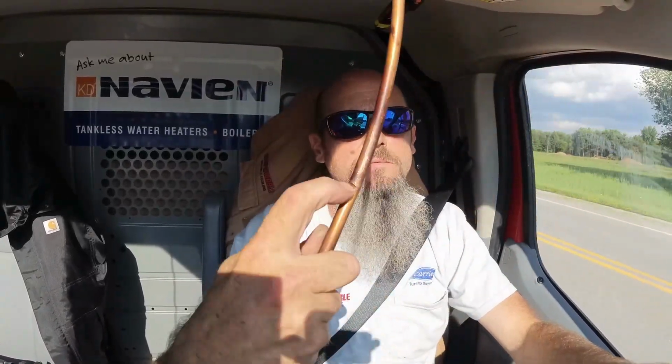So you seen that pipe? That was from the ceiling. Just chafed it away, just enough vibration. So what I did is I zip tied it, stuck some insulation in that hole and zip tied it together so it's nice and tight and bundled, and caulked it up really good. So there's no leaking, no vibration in there, so that can't happen again.